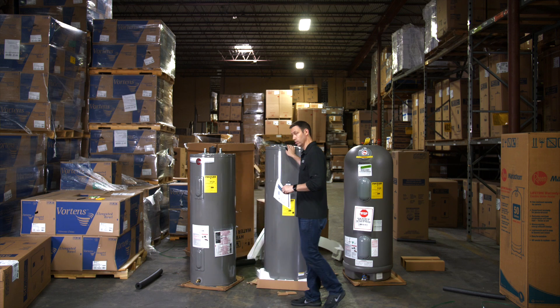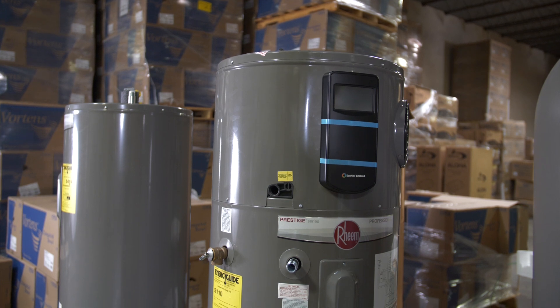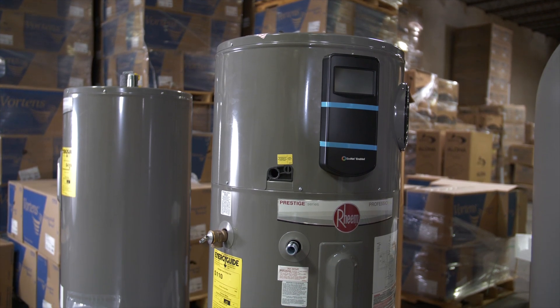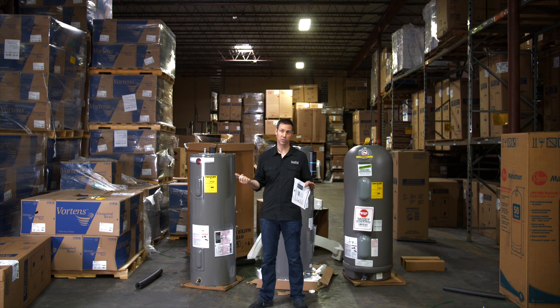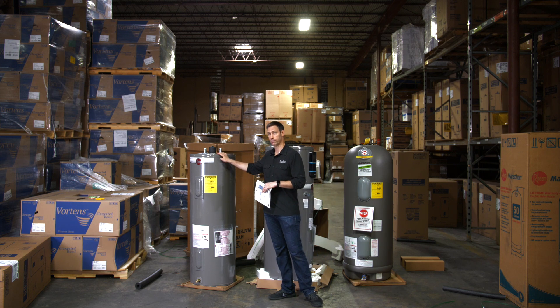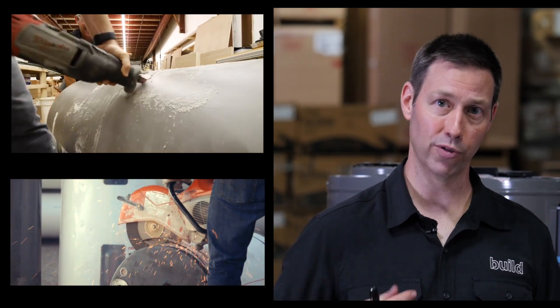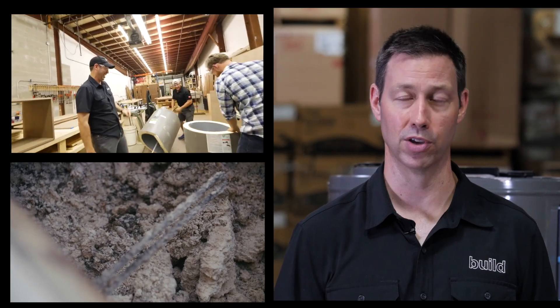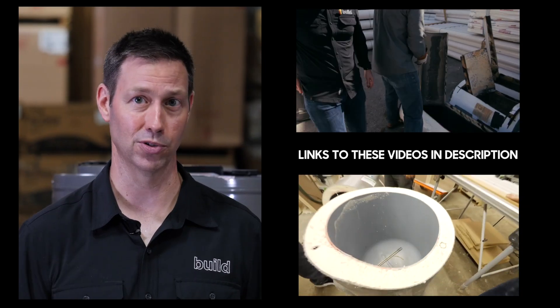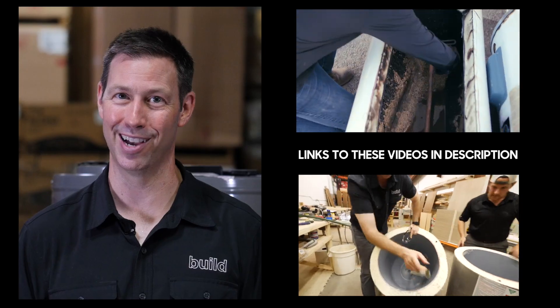Lastly, this heat pump unit has a couple of additional benefits besides just the low annual energy cost. I love the fact that its output is dehumidified, cooled air. And I like the fact that a unit like this could help you go net zero — if you put a solar array on your house, that array will have a much easier time feeding the electricity for this tank, which uses far less power than a standard electric resistance tank. I hope today's video was useful for you. I'll have links in the description to videos where we've cut these units open to see what's inside. There's also a playlist with a bunch of other water heater videos. If you're not currently a subscriber to The Build Show, we publish every Tuesday and every Friday — hit that subscribe button below. We'll see you next time on The Build Show.